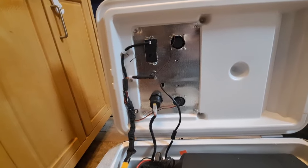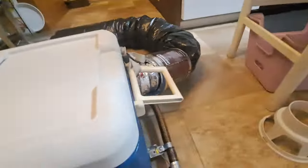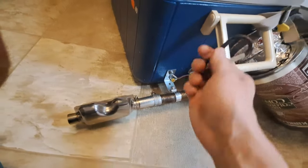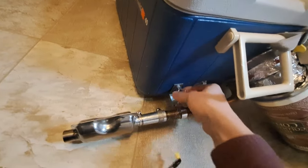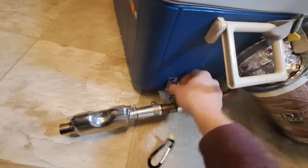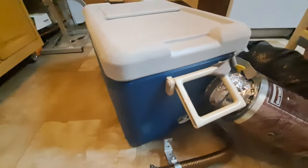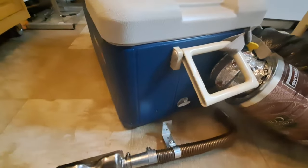Hot air out over here — I made the exhaust so it was easy to attach; I'll attach this to the strap there. Because we're working with a cooler, they use these threaded nuts that you put in with an Allen wrench, and those work awesome with coolers. I used one also with mounting the fuel pump, so if I'm taking that fuel pump out it's easy to do and I'm not constantly screwing in and out of plastic, which will eventually wear out.